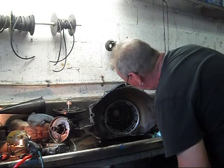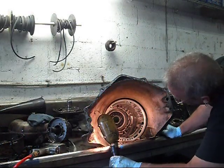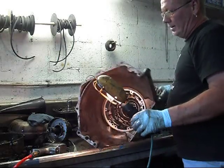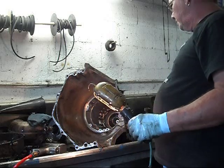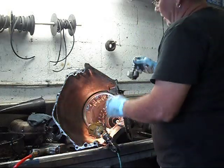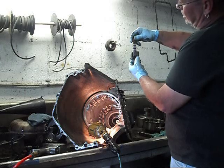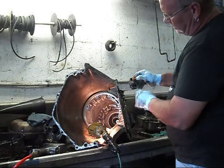This unit is in beautiful condition. Back in here we have one more part — a couple pieces, another piston, a low reverse piston, and the return springs for low reverse. Basically we're going to do a freshener on that unit — all new gaskets and seals, a set of new clutches, thrust washers, a couple bushings, and a new governor gear. The governor gear controls the shift — there's a little valve in there that gets clogged up with metal and causes the transmission not to shift. This also can give you a firmer shift by changing the springs in here.